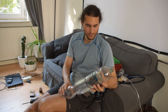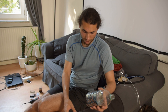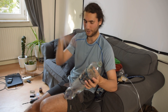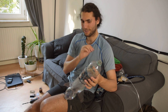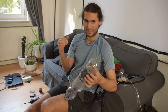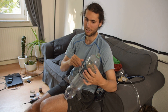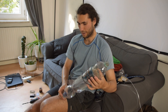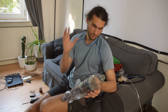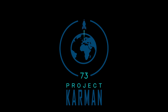We've already pressure-tested the bottle up to 5.25 bar, and we're going to push it to 6.9 bar for the launch — right up to the limit of what we're allowed to do. We've also tested the parachute, and it opens very nicely from the configuration we've molded it into. Once we get the electronics hooked up, we'll test the release mechanism too. We still need to add the altimeter, which hasn't arrived yet. But ultimately, we think this design works. The bottle is good, the fins are hopefully straight enough, and we're nearly there. If you have any cool names for the water rocket, let us know in the comments — and remember, to expand your horizons!